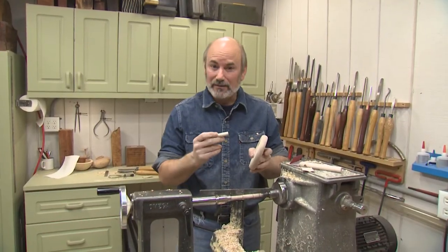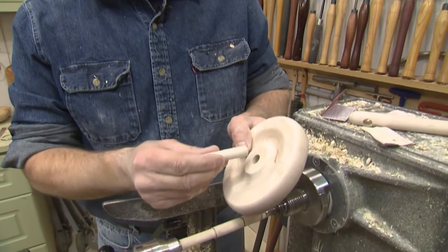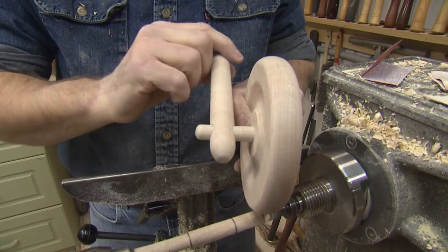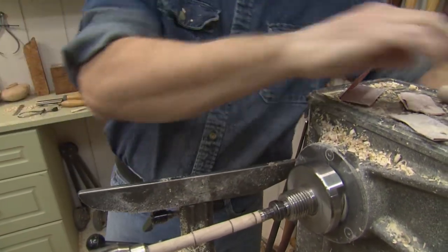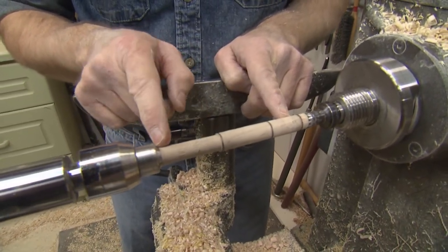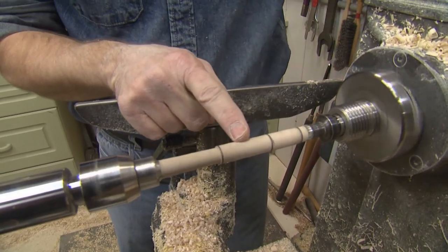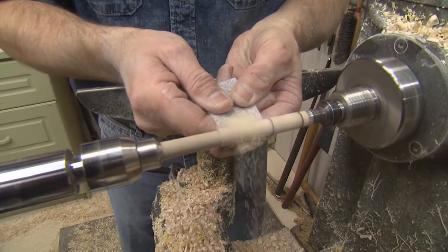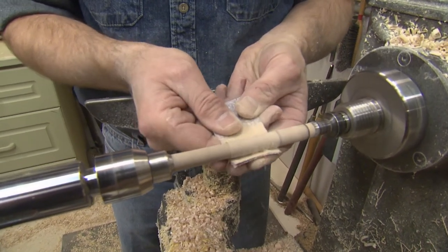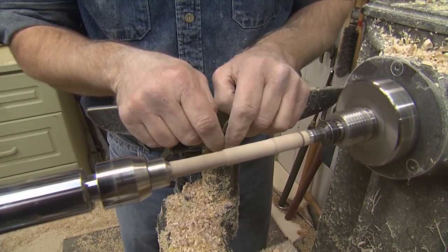Now if you want your lawn mower to move, it's got to have axles — and that's a critical stage because this has to work perfectly. What I've been working on is an axle. I have this one done already where it's a jam fit onto here. However, this has to be able to rotate freely. I turn this down to size and it fits jam fit. What I have to do right now is just take some 100 grit sandpaper and gently sand that down a little bit so it will slip inside that axle for a nice smooth fit but not too tight. Then I'll round this end down so we won't have any sharp edges.